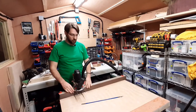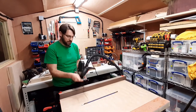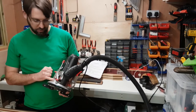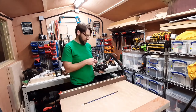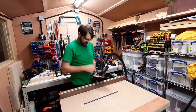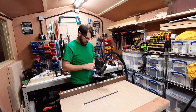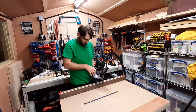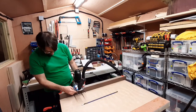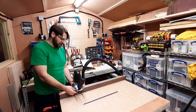I've just set up to route my truss rod channel. Truss rod — double action — it's going to go into the guitar neck. I've put in a brand new six millimeter bit into my router. I've set the depth stop at three stops so that I take off a little bit at a time and don't overburden the router bit. I've also connected my vacuum cleaner, and as a handy little trick, I've taken a key ring LED light to illuminate my way. I just need to push forward one, two, three, four times and I'll have a truss rod channel. I've already measured the depth.